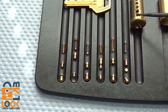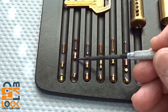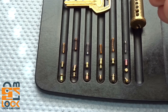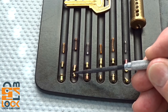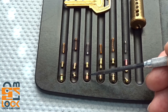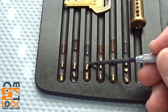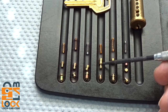Of course that chamber also was serrated. This was the tapered — it probably started out to be counter milled. We have some nasty cuts on here. Inside of the core itself, chamber number two is threaded, so that would have caught up the sharp edges on the driver pin right here. Chamber number three was threaded in the core, but nothing in the Bible. Very sharp edges here to grab hold of those threads. Very nasty.